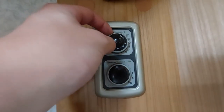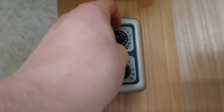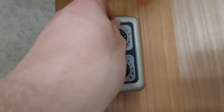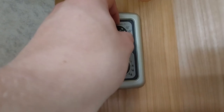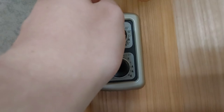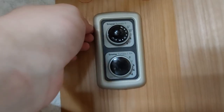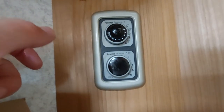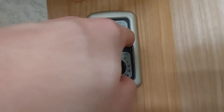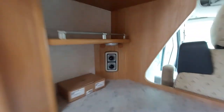For your water heating: in the off position it's on that O. If you want to run it off electric you've got the option of 40 degrees or 60 degrees. With your control panel on this will light up and activate. In the middle section it's off, and then if you want to run it off gas simply switch it like so. If you want a combination of gas and electric, which will equal about 60 degrees, you can do that as well. Just leave it in the off position when not in use and you're good to go.